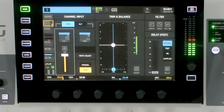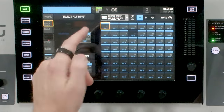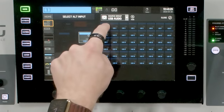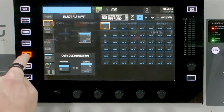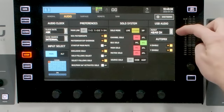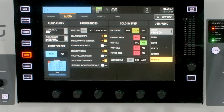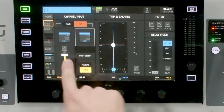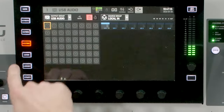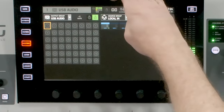I have a full nominal signal — a very healthy volume on this channel. I'm going to go over to my alternate and press card one, then select USB audio and select USB one. Now, if you go to this page and only notice two selections you can pull from, you'll need to go to Setup, then the Audio tab on the right-hand side, USB audio, and select between two, eight, 16, 32, or 48 in and out. I'm going to select 48 to allow me to process all 48 channels going into Super Rack Performer. Going back to my channel, I can see I'm still on USB one. Next, I'll press Routing, go to my output group, make sure that is on USB audio, unlock, and press auto plus one.